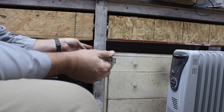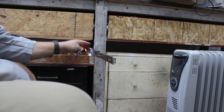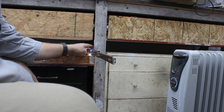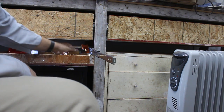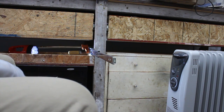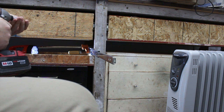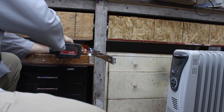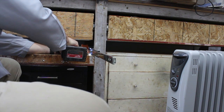And I've got it fully extended, which exposes the front hole here on the bracket that mounts on the leg and the brace. And so that allows me to come in with my screw, and then I put a clamp in to make sure it stays in good position. So I can put in my screws here with a star drive. Don't try to use Phillips screws for something like this.